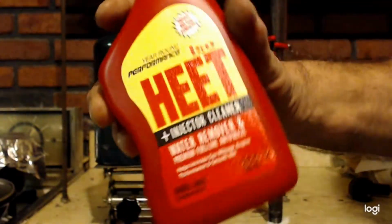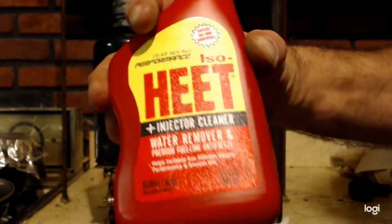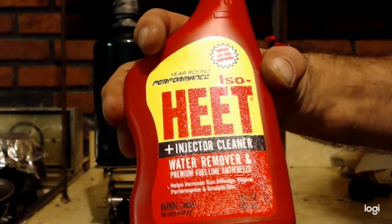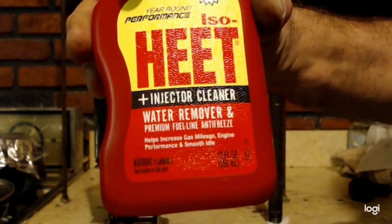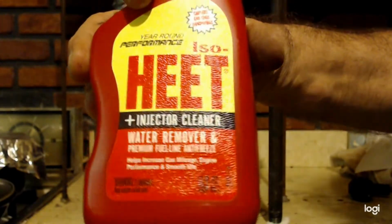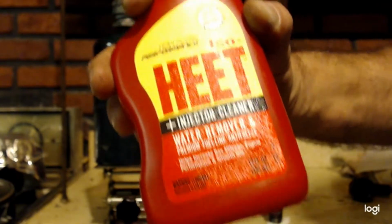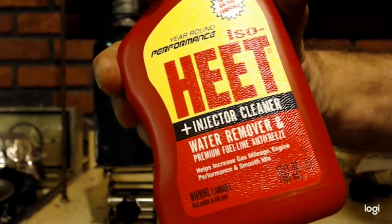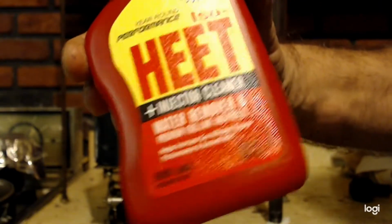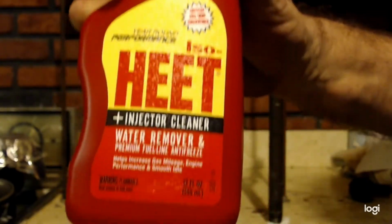But what I'm going to do, even though you can probably use this just pure as it is, is at least throw some magnesium sulfate in there, just in case, just a little bit to dry it up a little bit, and use it just like that. Filter out the magnesium sulfate, and you've got some anhydrous isopropyl alcohol where you really didn't have to do anything. If you really want it super pure, distill it and take out the first few mils and the last few mils, and keep everything that comes over at exactly the boiling temperature of isopropanol.